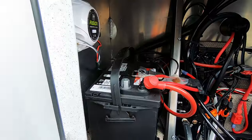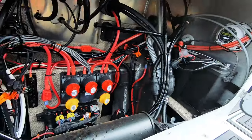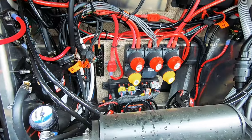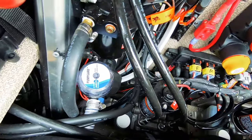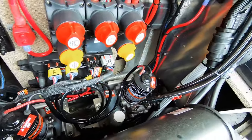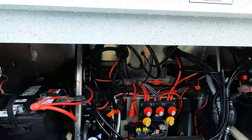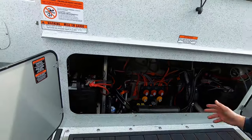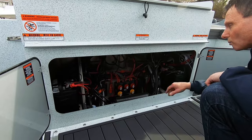We've got twin batteries, one for each 200 horsepower. We've got twin six-volt batteries making up the house bank in the back. This has got the automatic BP switches, which are actually turned on and off by a switch in the cabin. Everything back here is fairly easily accessible, wide open, and well marked.